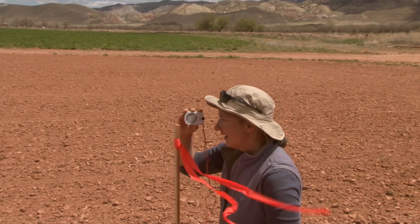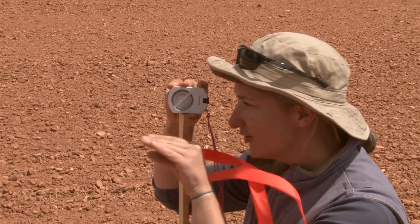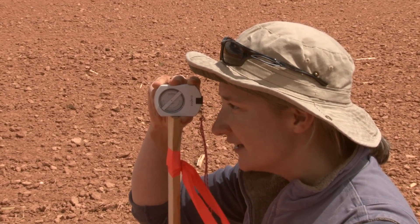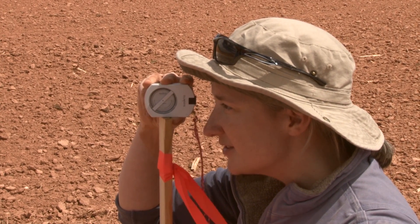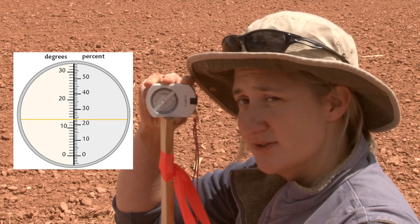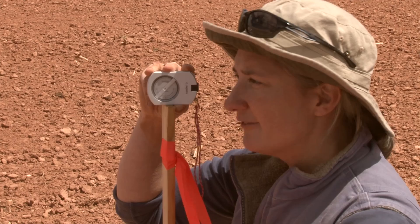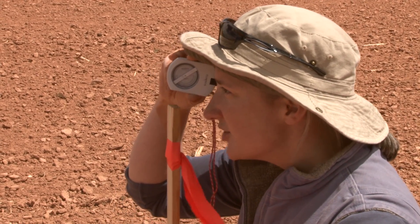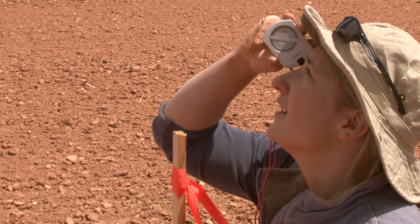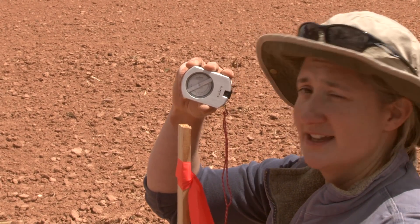I'm going to place the clinometer on top of the stake. Sometimes if your stakes are really close together you need to angle the level meter line on the inside of the clinometer to just above the stake. These are pretty far apart so I can aim straight for the top of the stake. There are two meters inside this clinometer — one side reads percent and one side reads degrees, just like a protractor from geometry class. It's important to read the correct scale. This one happens to be a one percent slope. If confused, turn the clinometer up toward the sky and at the bottom of the percent slope scale there will be a percentage sign. The percent scale also goes up in number very rapidly, as opposed to the angle scale which wouldn't reach 100 degrees unless you were turning over backwards.